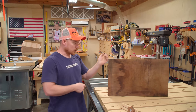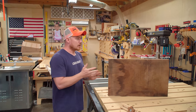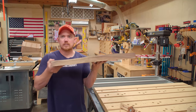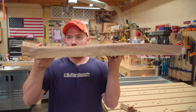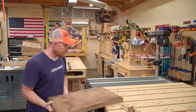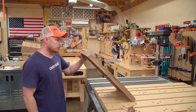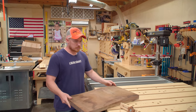Especially considering this was built in the 1850s. So, of course, bit and brace, you drill halfway through either side and you meet in the middle. But I have this one large piece of walnut to do that, but look at the way that it was sawn. So crazy. I guess there's a lot of blade drift during this. So this needs to be milled flat and square over the course of several days. And the final milling won't take place until we actually fit it into the chest.